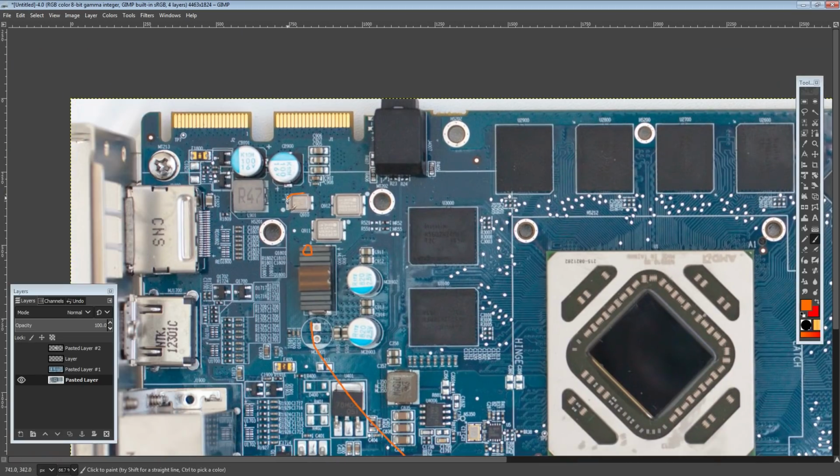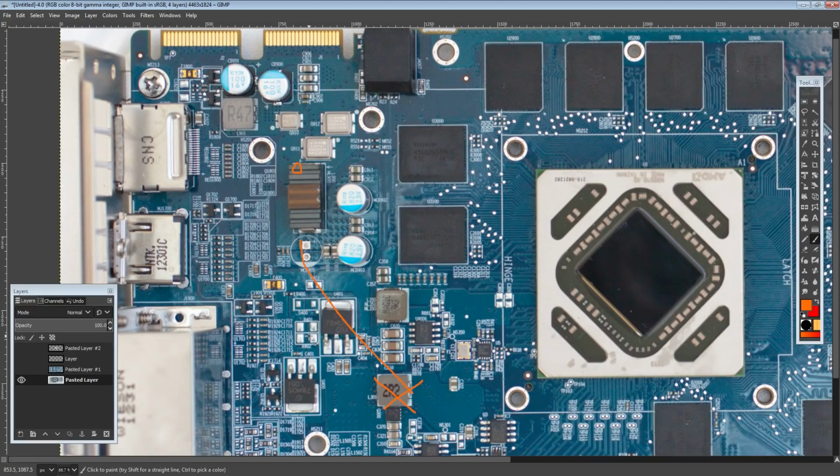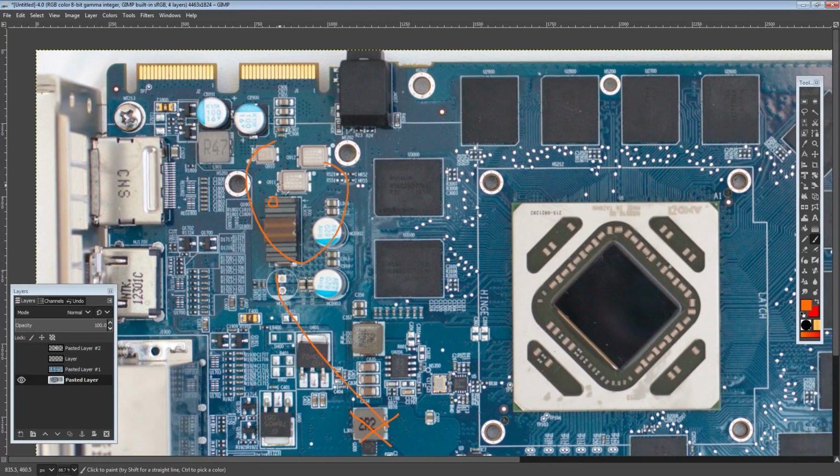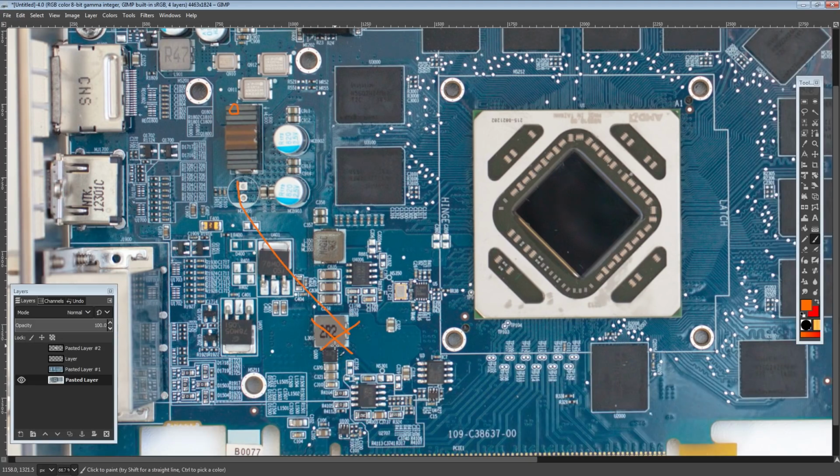The main concern is just not letting this voltage regulator overheat. That's my main concern. I don't think it's actually that much of a risk because, quite frankly, this rail really shouldn't be pulling much, it should be single digits of current, whereas this one should be, it's not that big a difference. I think this one's like 10, 20 amps, and this one's probably like 1 to 5 amps. I don't think it's 1 amp because you could probably just use an LDO if it was a 1 amp rail, but it's not going to be much more than 5 amps.